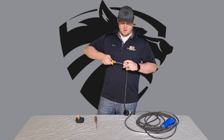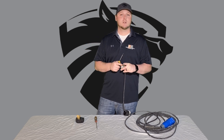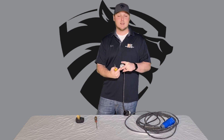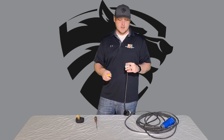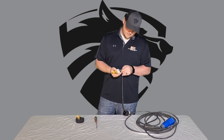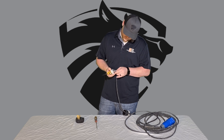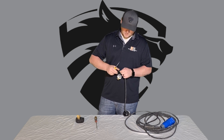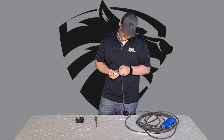Just to recap: ground goes to the L-shape, the other two wires go to the east and west sides, and the south side of the plug stays without a wire. Always twist your wires and get them as small as you can so they fit into the little holes.